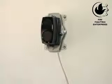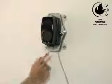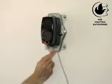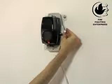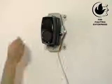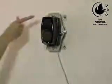You can check the beam detector is centered on the reflector just by touching each edge, then the top and bottom of the detector head. When you touch each side of the detector head, there will be a short flash of the amber LED to indicate the beam is slightly off center of the reflector, and when released, no LED lights to indicate the beam is centered on the reflector.